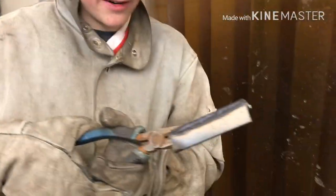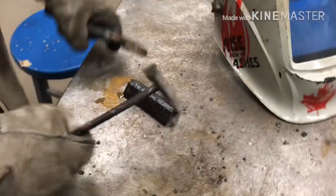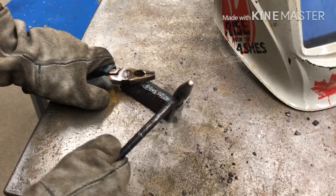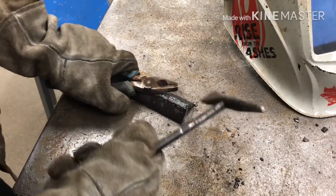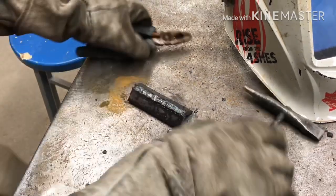We have finished the weld — see what it looks like now. We have the weld here, but for now we need to dunk it to cool it off, and it will steam off. Now that we have dunked it, what we need next is a hammer. Then you just want to chip off all of the slag. For some reason there isn't very much on here — sometimes that'll happen. So you want to get all of that off. Then you will need one more thing — a broom or a brush. You will brush it off.